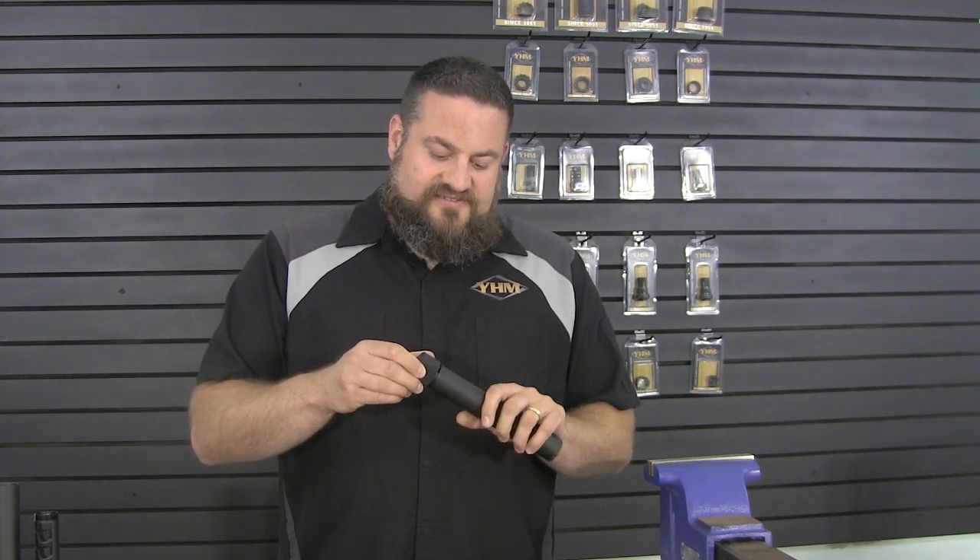Up at the front of the suppressor, we've redesigned the end of the baffle where the takedown tool engages. It has a design that flows more with the rest of our series, but we've also removed that little scoop that the M1 version had. We've redesigned the tool to be a little bit simpler, and those two combinations create a much more firm lockup between the two parts. There's less chance for the part to slip and mar the finish, like on the M1 version. So it's an improvement to both the tool and the mating part to make the disassembly process easier.